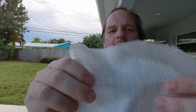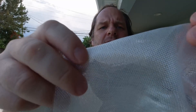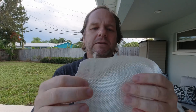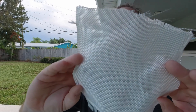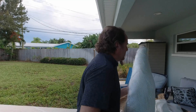The next one up, you move into about a four ounce cloth — this would be good for a surfboard or something like that. The weight is the number of ounces per square yard of the fabric. Then we move up to this cloth, about seven or eight ounces. Usually about six ounces and up is typically used for boat building — they'll use a woven cloth like this. And then finally, woven roving — this has huge strands and is a very heavy duty item.